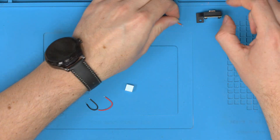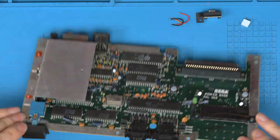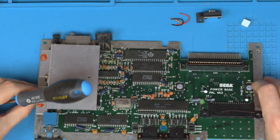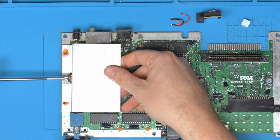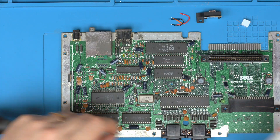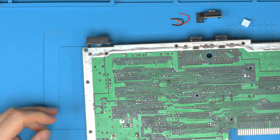With that in place, let's bring in the actual motherboard for the Master System. We want to remove the old heat sink because it's not needed anymore. Remove the two screws from underneath holding it down, then flip over and there'll be another screw holding the heat sink to the regulator — remove that as well. You can leave it in place if you want. Now we want to bridge the input and output of the regulator together instead of removing it, so it's easier to reverse in the future.